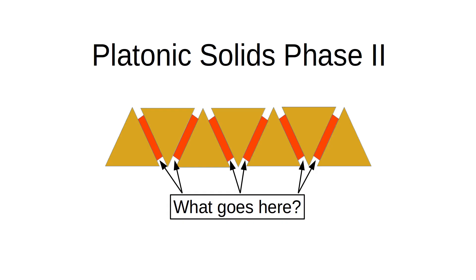This was a classic collision between the abstract mathematical realm and reality, and I tried to think of a way to bring more of math's perfection to my models. Then I realized if I could design a polygon face — like a triangle or a pentagon — one that could be assembled into a solid, then only a few face types would be needed to build all the platonic solids. And because the faces were flat, they would 3D print more easily. But to make a solid, the faces had to join together at the edges. Any face edge had to easily attach to another regardless of orientation, and the connection had to be able to rotate, or hinge, along the connected edge. I needed a universal connector — not a plug nor a socket, but something that was both at once.